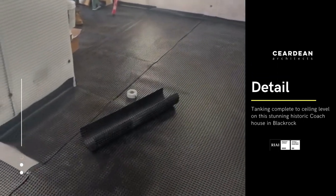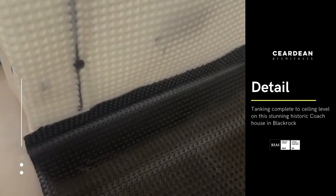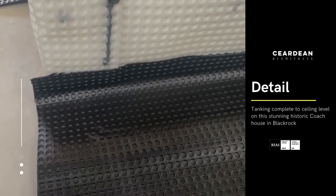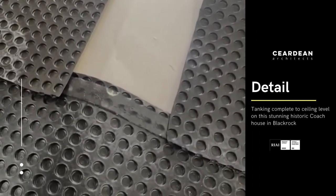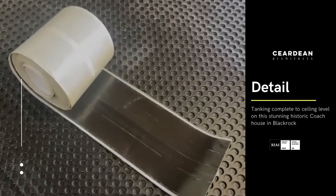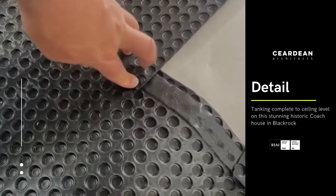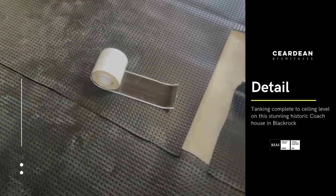You can see here the floor has been attached to the wall sheeting. The floor is a more robust and rigid product again with a ripple, and you can see it is glued together with a bitumen tape — here is the bitumen tape product used to fix it. It's a very tight fixing, totally bonded together, sitting into the riffles on the fabric.